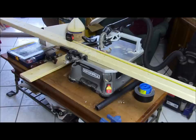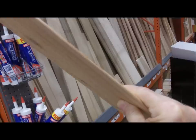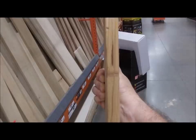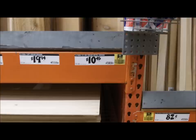Let's get to the hardware store and look at the lumber. The first piece was fir beveled siding — about $10. It's a really nice material, 12 foot long, and I used it to make the lee boards. It's thin on one side and thick on the other — a perfect piece of wood. You can whittle it down and make a nice foil for a lee board. Quick and dirty, very lightweight and super cheap. In fact, I almost thought about getting some thin sheet metal and putting it over the wood to make a composite, but since I didn't want to spend a lot of time, I didn't do it — though it's something I might do in the future.